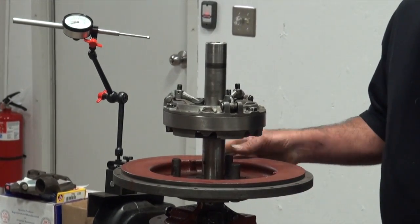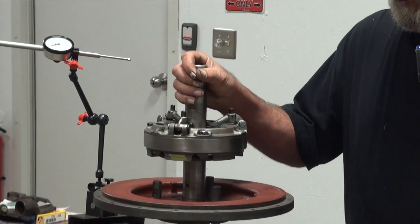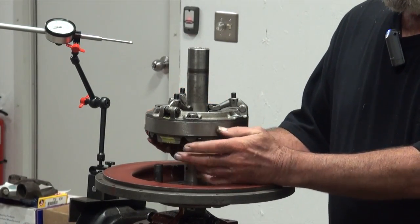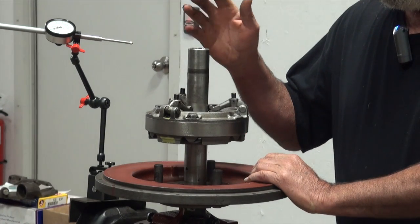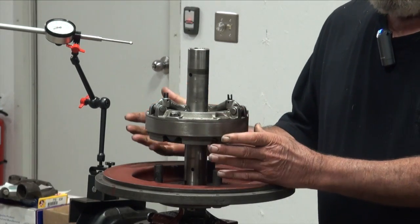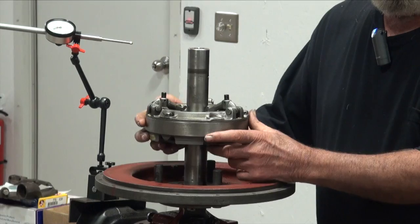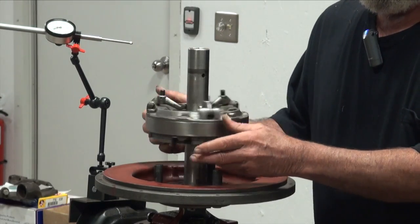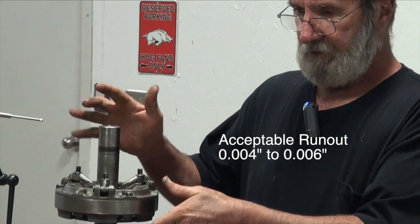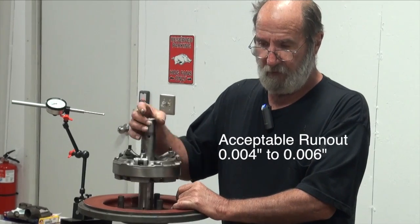We have no magnets on it at this time because it's lighter to lift on and off. We built up our brake drum and drive plate assembly, put new bearings in it, line bored the brake drum and two bearings, machined off the flange surface of the brake drum, machined off the installed bearing in the drive plate, center bored it, and machined off the flange that mounts to the brake drum. The purpose of doing all that was to get the least amount of runout out where the fourth main runs. Something in the neighborhood of four to six thousandths is acceptable because we have bearing clearance in there and this thing is about eleven inches long, so it does have some runout up at the top, but four to six is acceptable.